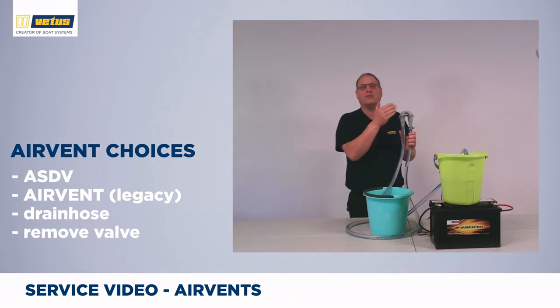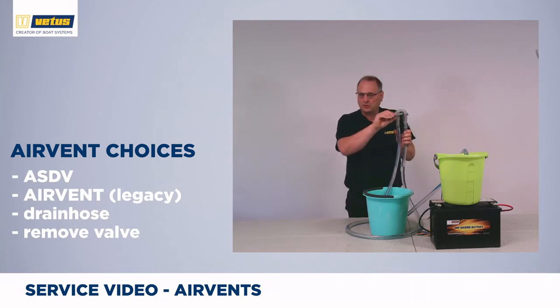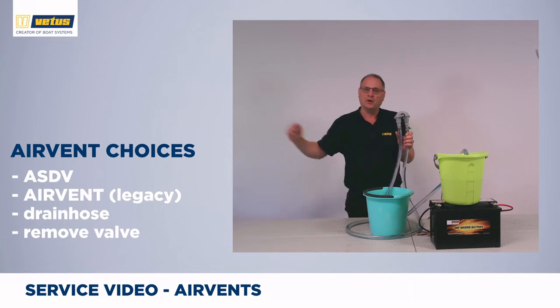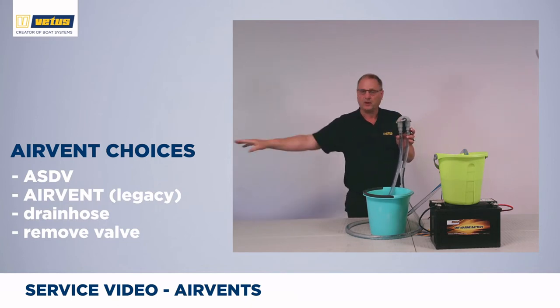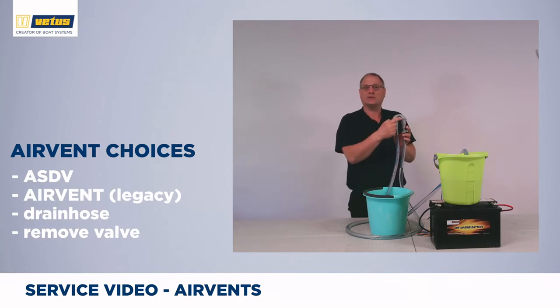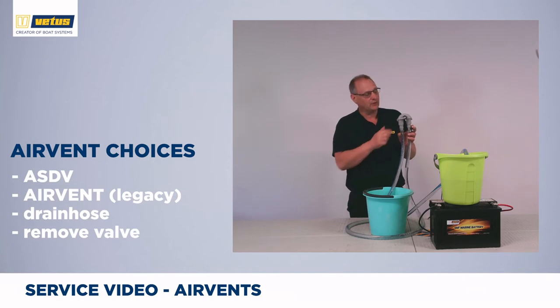That can create pulses and the valve might open a bit, allowing a couple of drops of water out. You can install a hose — make sure it continuously runs downhill and that the hose ends in air, so any water that finds its way into the hose can drain out. As an alternative, if you run in very dirty water, you can completely remove the duckbill valve and put the cover back on. Once you've switched on the pump, water will find its way continuously out of that hose. If you switch off the pump, air will enter the hose and block the siphoning effect. It's a very fail-safe way of working, but the duckbill valve works extremely reliably as well.